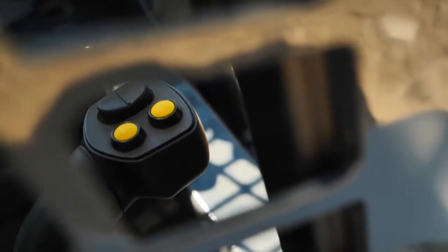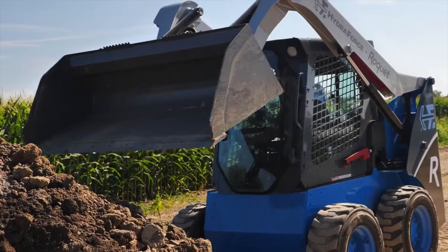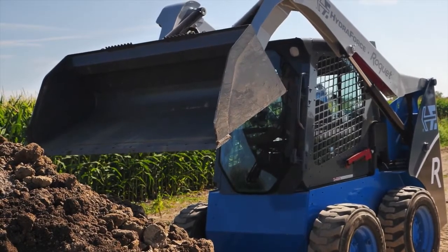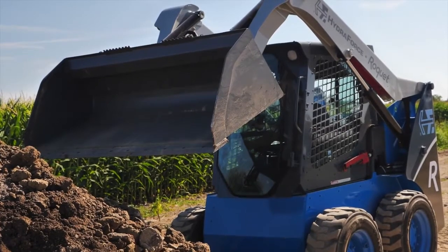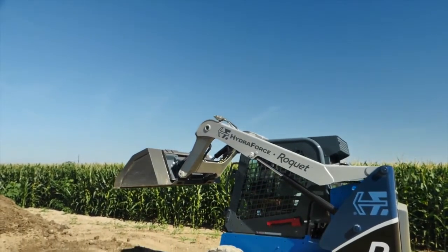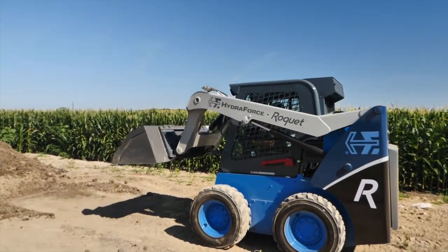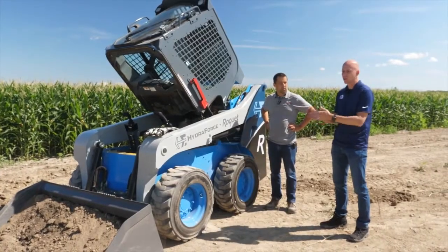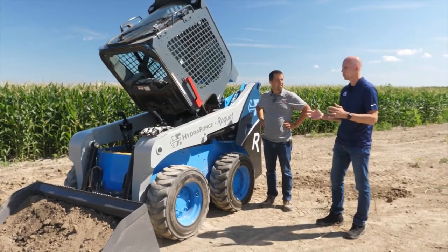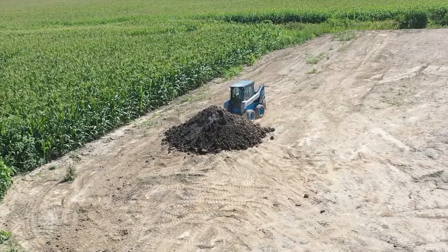And so for us, wanting to promote and grow and support the growth of electro-hydraulics, we came up with a solution that would improve the responsiveness and decrease some of the hysteresis, which improves the quote-unquote feel on the machine that we anticipated would improve the feel on the machine. And it allows us to also tune it, so maybe customers who want it to feel slightly different can actually be made to feel slightly different.